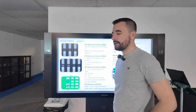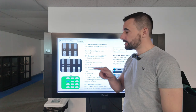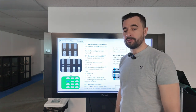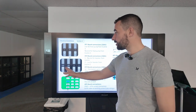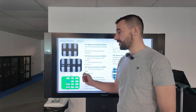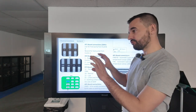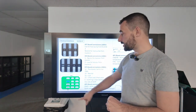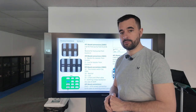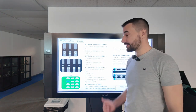The XT1 connector is the power for the heat pump. From the isolator box down into the heat pump, you connect your live, neutral, and earth for the heat pump supply. The XT4 is the booster heater supply — you have your live, neutral, and then an earth terminal next to it. The AP5, which is to the right hand side of all these connections, is where you plug your touchscreen control cable in into CN22. I'll now switch to site to show you all of these connections and where the cables connect into.